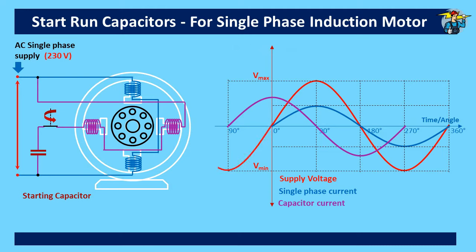Like in the three-phase supply, the motor is now getting a two-phase supply with a 90-degree phase angle difference. This will last only for a few seconds, but this period is more than enough to make the magnetic field rotate, making the single-phase induction motor run on its own without any starting issue.